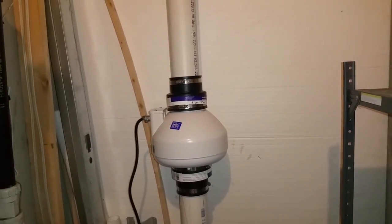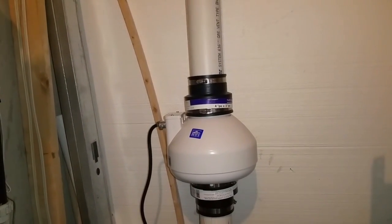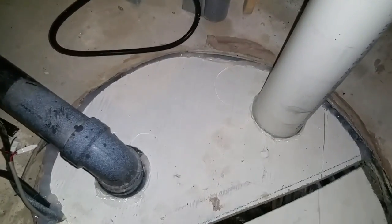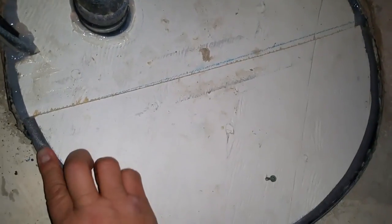So far I've reduced my radon levels from 2.0 down to 1.0, and I measured it right away after installing the system, which means there's still residual radon in the house — I'm expecting my next measurement to be even better. The other thing I wanted to mention: I don't have a hole in the lid. Commercial lids come with a small hole — maybe the size of a screw head — just so some air can get through in case you've sealed it too tightly. I elected not to put that in right away, but I'm going to drill a hole and retest my radon levels.